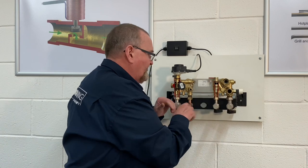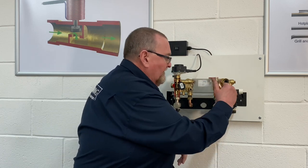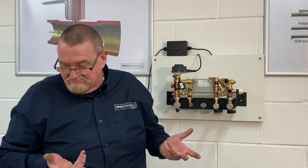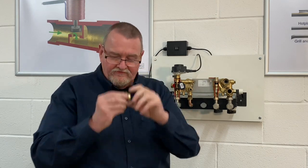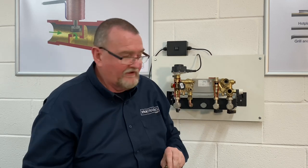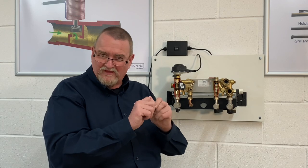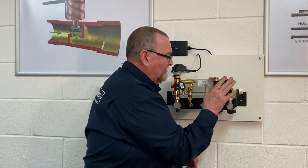That's now changed this hydro block virtually into an Eco Blue hydro block. The Eco Blue doesn't have the same jig but the hydro block is the same. Components like the cartridge, motors, drain points, and PRVs are all interchangeable. The only other difference is the pump O-ring — the original has a haunch on it and the newer one just has a groove that fits into the back of the pump. Use a little silicone grease on the O-ring, or simply use the palm of your hand to push it in.